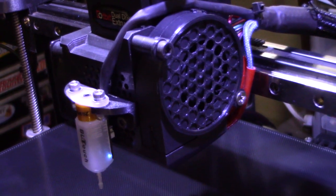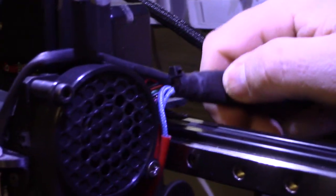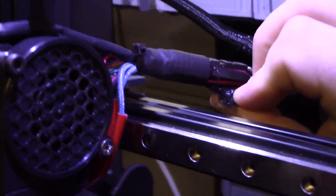I've actually had this before, not with this printer but other printers. I just put together this printer and I've been printing with it for a couple days. But on these BL Touches, you have those connectors, and sometimes inside these cables they can kind of wiggle loose — either here. It's usually in this cable, but sometimes it'll actually happen in the box too.